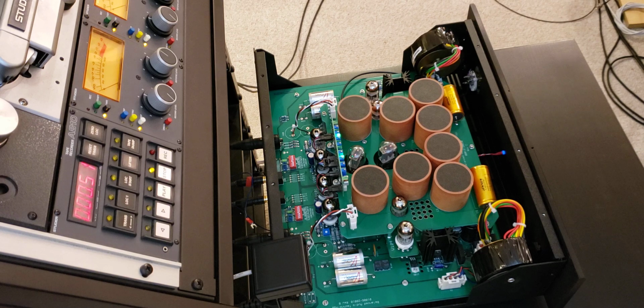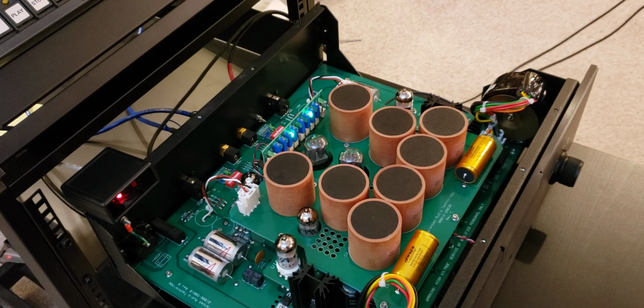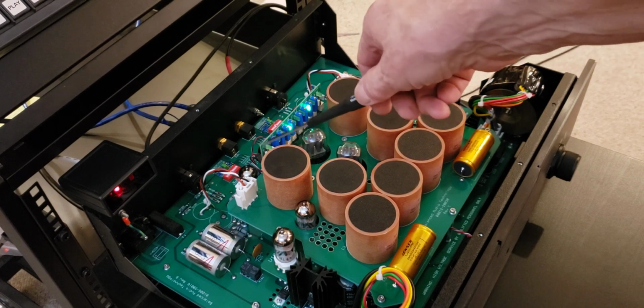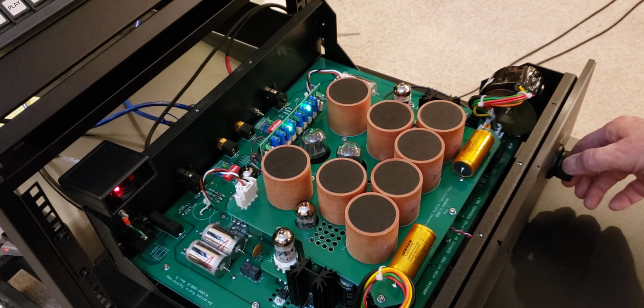How do you do it? Here it is done by switching, but you can also put a trim pot there. And a trim pot is nice if you're using a flux loop on your tape head, and you can monitor for the oscillation peaks and control that peak through selection of input resistance. Like I said, the equalization circuit has 5 different selections, all controllable through this switch.